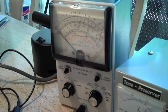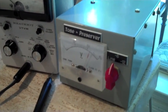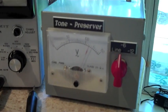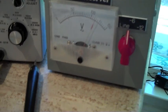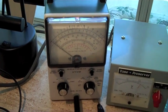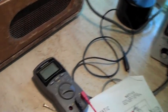It cost me 51 dollars plus shipping. I wanted to show you that I actually got this. My line voltage is usually 121 — I've got it down to about 115, just a hair less. I just want to get it close to what the old 60s voltage used to be on these schematics. And I'm going to check the AC voltage coming out of the power transformer right there, the two red wires. I'm actually trying to calibrate — or see how accurate the vacuum tube voltmeter is compared to a new digital meter.